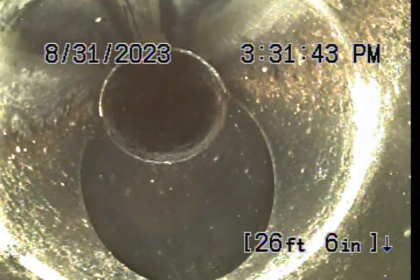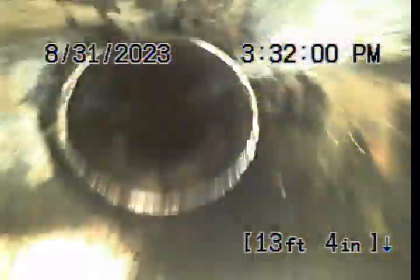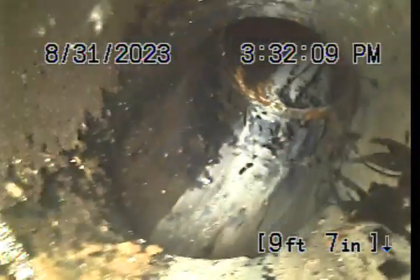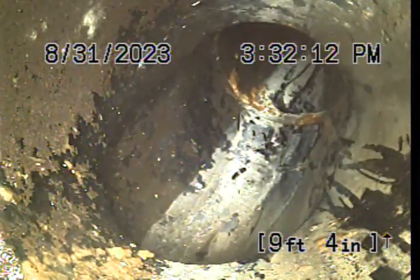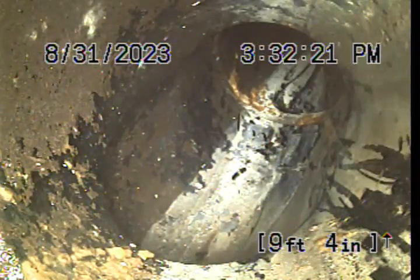The sewer permit did not detail if there was an outside clean-out or not. There's a fitting there, another fitting there. You'll see some tie-ins coming into the building drain — right there is a 4-inch tie-in. Here is the Y fitting tying in drainage from the basement bathroom group. That was the customer's concern, as that's the only toilet mounted to a flange right now. The customer is going to flush some toilet paper and we're going to verify that it's coming to and through this point.